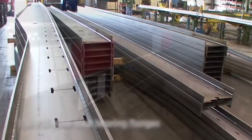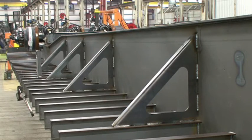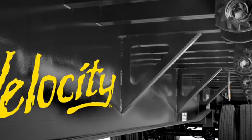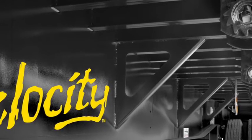These fabricated main beams are made with positive camber in order to accommodate expected loads. The Velocity features one-piece fabricated steel side rail braces and supports, which are spaced approximately 60 inches apart. These serve dual purposes, both to strengthen the main beam web as well as providing heavy duty support for the outer side rails and deck.